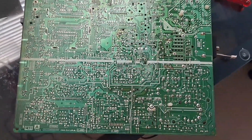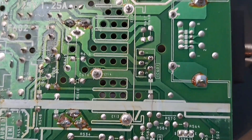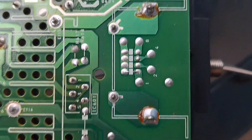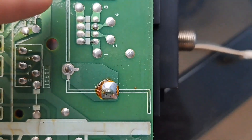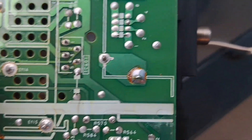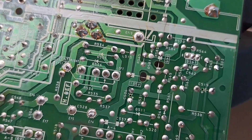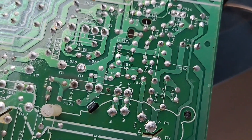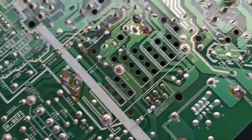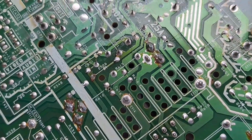I have my circuit board now on my desk. The board looks okay from a distance, but there are some compromised solder joints. For example, these two here are actually cracked — this one and this one. There's a couple others I'm going to be checking over. Any one that kind of looks a little weird, I'm going to be looking over. There's also the other source where that spark happened that I want to try and fix. This board has definitely taken a little bit of abuse over time. There's a bunch of gunk and crap on it from flux, but that doesn't really matter.